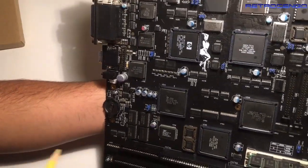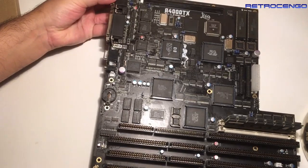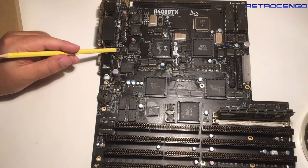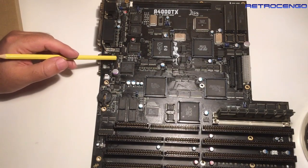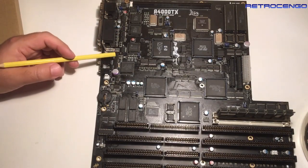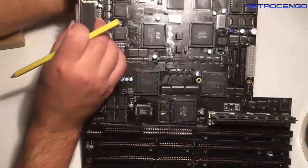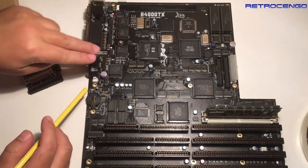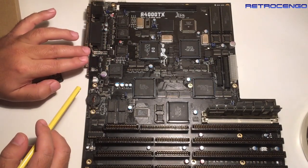The one thing that I'm just missing on this card, one simple thing, I know you have guessed it, is, where is the RGB video out? And that's down here, guys. It's just so sad that I would just love it if Hesse removed one of the parallel or serial ports, or just put it up here, with the next revision, just have it on board here. But he has done what Commodore has been doing on this revision D. You just put it on here, and from here we have ribbon cables, and we are going to install RGB video out, but that cable is on its way.